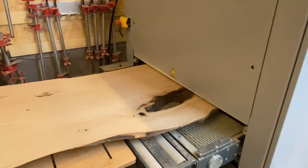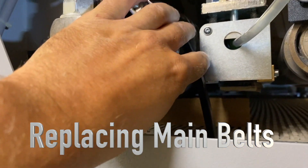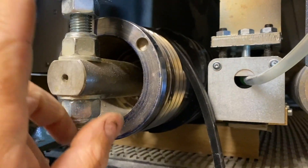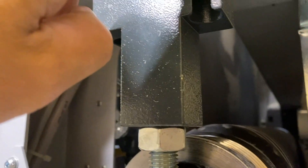I'll walk you through it now. Remove the side panel and remove the old belts — they looked really haggard, and I think they'd come loose and twisted as well. These have got a nice deep V. Remove the two screws here. I don't want to change any alignments on this main part, so I remove the two allen bolts there.